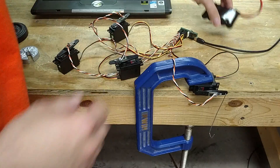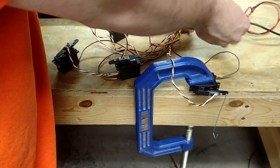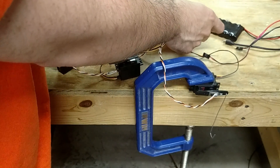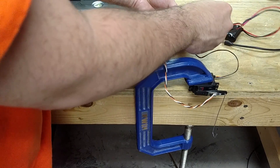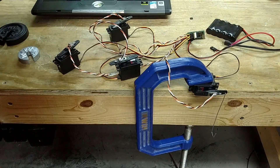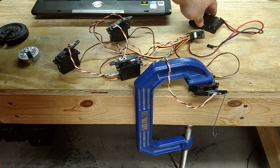Ta-da. We'll go ahead and hook it up and unplug the USB. The power jumper here I need to remove to tell it I'm not going to power over USB — I'm going to power over this. And if I plug that in, now we're running. So no USB, unplugged completely. I just got the battery pack.